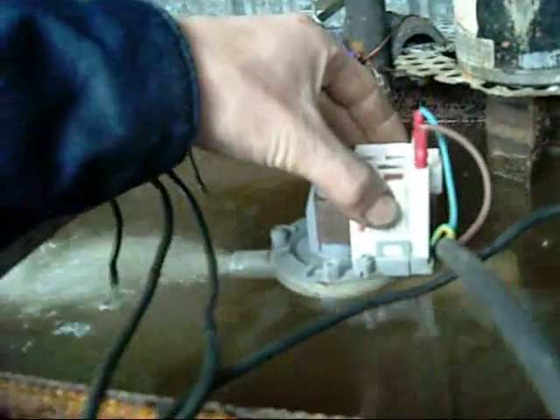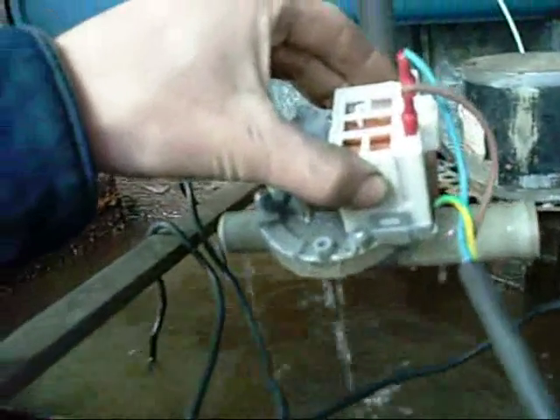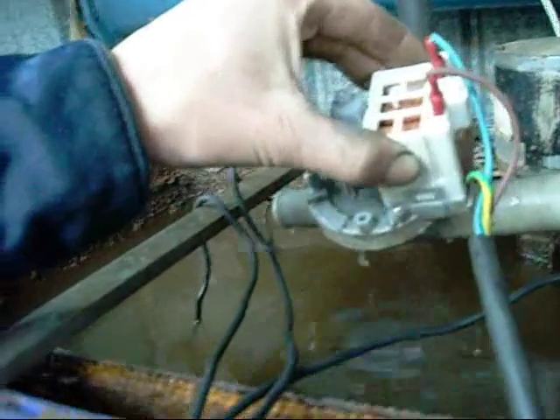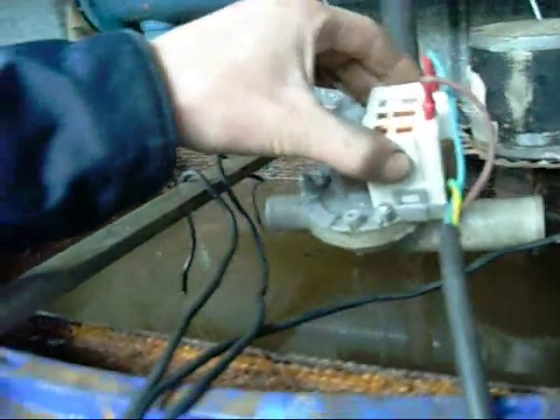It's got a lot of thrust. It tends to oscillate when there's nothing going through it, because the rotor is probably over-speeding and stalling. But once the rotor is actually under load, it really gets in and starts pumping well.